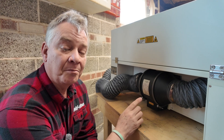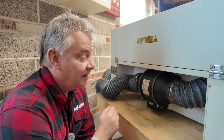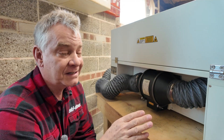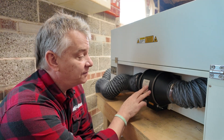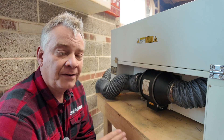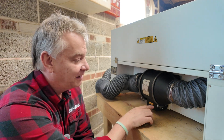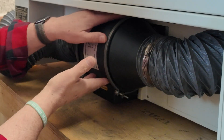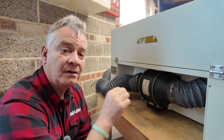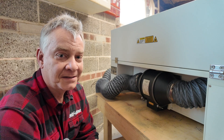One big factor that can impede the exhaust fan's ability to clear debris and fumes: you have to clean this fan. I got lazy — for the first five, six, seven, eight months I was diligent. I clean my mirrors and lenses every day or every second day depending on how much I'm lasering. But this fan will slowly accumulate debris and build up on the fan blades, and that will absolutely have a negative effect on its ability to exhaust gases and debris outside. It's pretty simple — just two Phillips screws, take the rings off, pull the fan out, grab some cleanser and an old rag, and clean out all that debris thickening on the fins. It's a must-do — add it to your maintenance list.